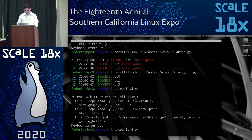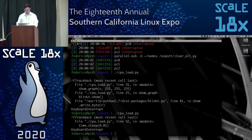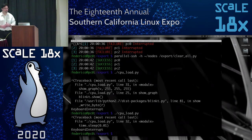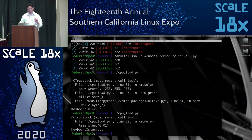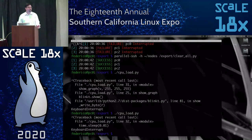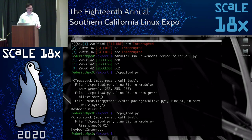And that is one more thing. Let me see. Okay, clear? Good. These arrays can be programmed in Python 3. They're pretty easy to use, so not much surprise there. The only caveat is that you need to have a little bit of pause between the updates, otherwise you see as much flashing as you have seen right now. Maybe the speed of update is not as prized as not giving people seizures with too many flashes. So maybe slowing it down a bit would be a good idea. But that's entirely within your control because these are 20, 30-line Python scripts at best. Most of the work is just getting the data into a form where you can show it.